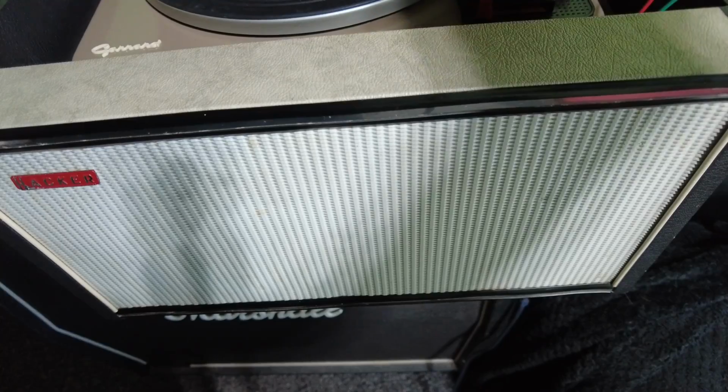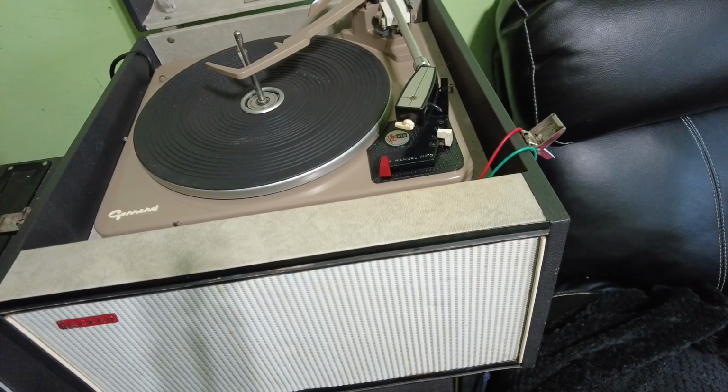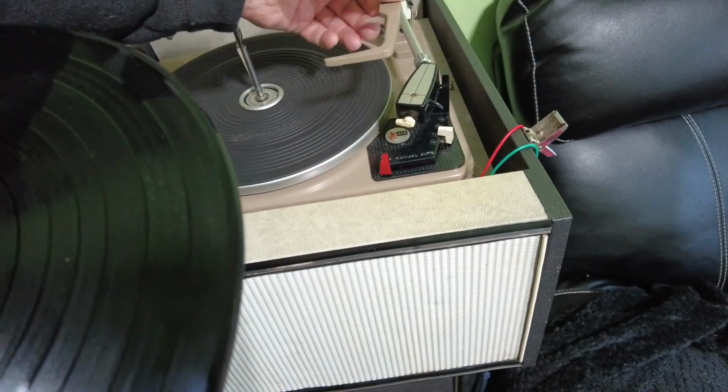Now this is incredibly loud with the record deck, not so with the digital signal off the phone. Could also hear that humming, and a lot of these record players do that, and you get some very small guitar amps that do it, because the switch is on the volume, you've got the AC from the switch, and it always causes that hum. So there's not really a lot we could do about that except by dismantling the main switch. So if we just pull this back a bit, I'm just going to give you a very minute blast of one of these tracks off this album.